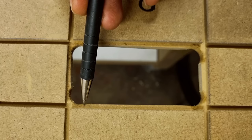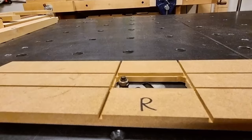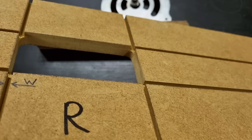I jigsaw so that only part of the saw groove remains — and just like with drilling, don't cut outside the saw grooves. The final step is to rout away the remaining waste in the hole: I install a router bit with a bearing on top, set the height so the bearing rides on the saw groove surface, and rout away the waste. The hole is now complete.